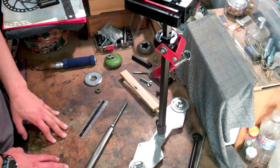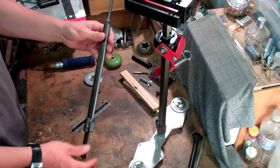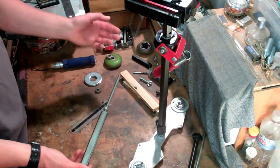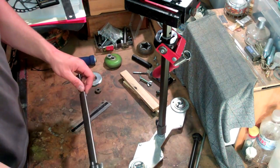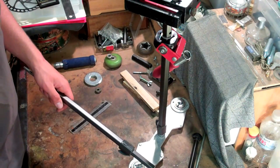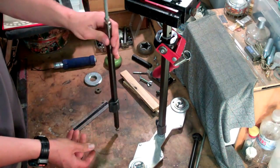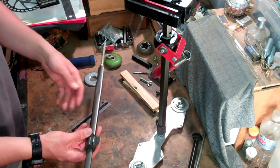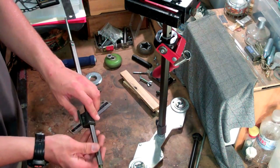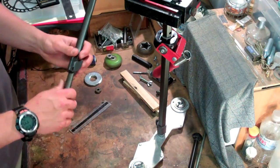The next piece of the Glidecam is the main shaft, onto which you attach your base plate, your platform on top, and your gimbal. The best material I found is a tripod leg — I had an old tripod laying around that I tore apart. You can find them at a thrift shop for 5 to 10 dollars. You need something extendable so you can adjust the length and fasten it. For an average-weight camera of about 3 to 6 pounds, you'll want a range of maybe 10 inches closed to about 15 inches extended.